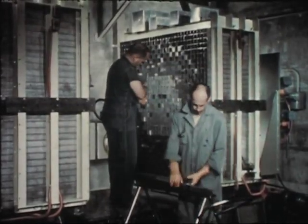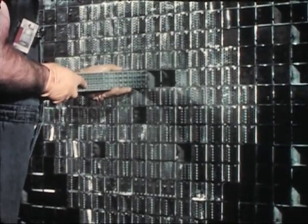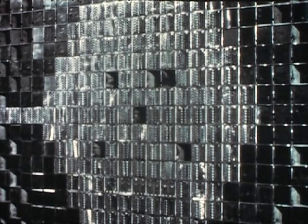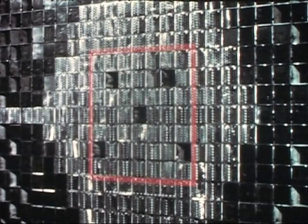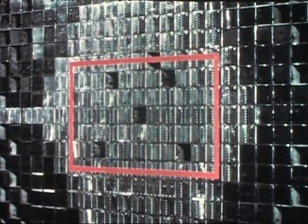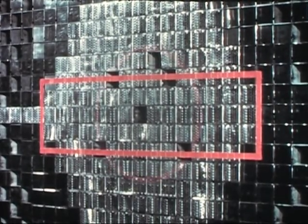These quantities are dependent upon the dilution with other materials and the ratio of enriched uranium to depleted uranium. Since operation of ZPR-3 began, more than 30 critical assemblies have been studied, ranging in critical mass from 46 to 221 kilograms of uranium-235, and varying in composition, size, and shape.